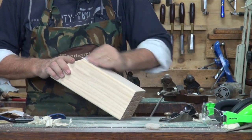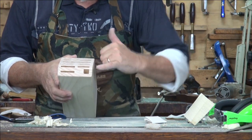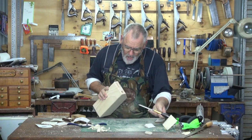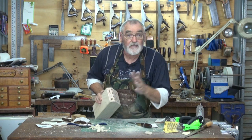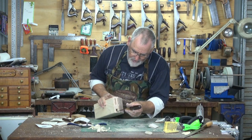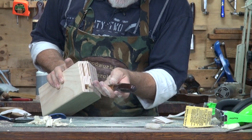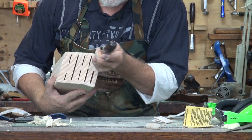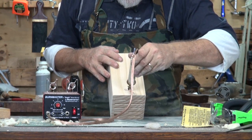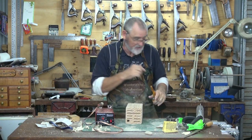Now this is nearly done. The other thing is to double check to make sure this steel hole here is nice and square — sometimes it'll move when you glue it up. All you've got to do is get a half inch chisel, and where the timber's sitting proud, just poke it down there and pare it down on both sides. If it's poking in on this side, it means it's going to be poking in on the diagonal. Because it's two different bits of wood, clean it up like that — turn it over, clean that up. The other thing I love doing, especially with things that I make on the show, is I put a brand on it — right about there. And there we go. Then we'll put the finish on — it's going to pop out.